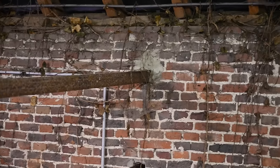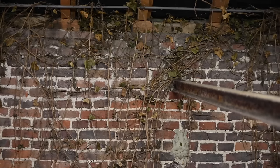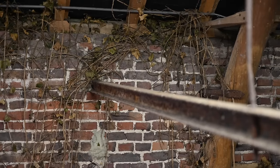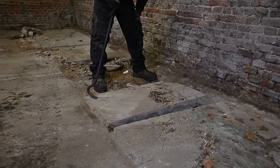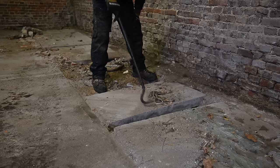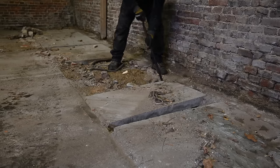Here we have one of the top walls that will have to be repointed — that'll take a bit of time but it's the right thing to do. I'll also need to clean up all the walls and get the ivy off. This is dried-up ivy; I moved the ivy on the outside some time ago but there's still a lot of cleaning to do. I don't want any of this debris around, especially if we're going to polish the concrete floor. This is the old air ducting channel — already filled up with debris, mostly old bricks, and the panels don't line up, so I need to get this right before pouring concrete on it.